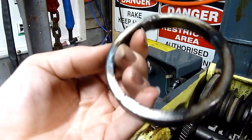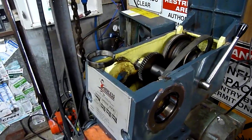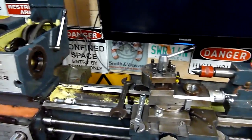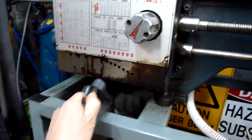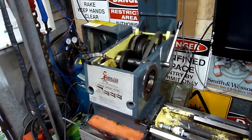This one's gone cold and a bit sticky. The story behind this machine — this machine had polyurethane poured in the headstock instead of gear oil by accident at a local college, and a good friend of mine picked it up for basically free. He wants to spend a little bit of money making it good again, so we're doing the spindle bearings which copped the most of the abuse, and I've cleaned up the quick change box and everything. The bedways and everything are almost new, all the scraping is still visible, no major scores or dings or dents — a couple of tiny little pock marks, but for a freebie, it's worth spending a few hundred dollars on.